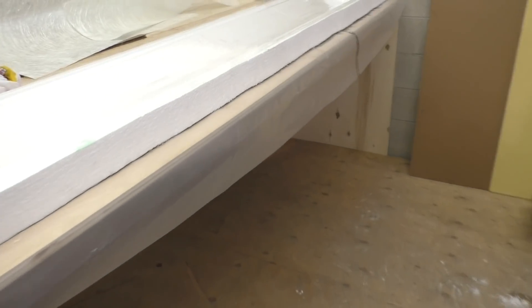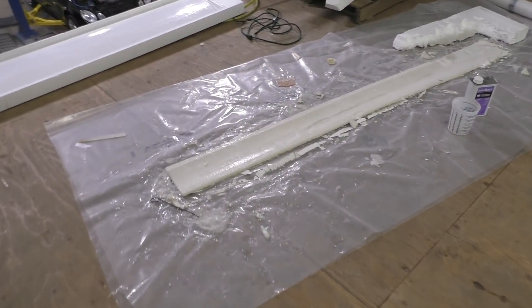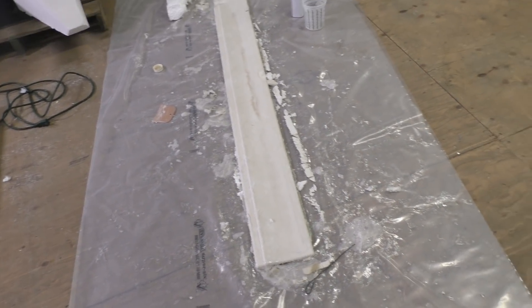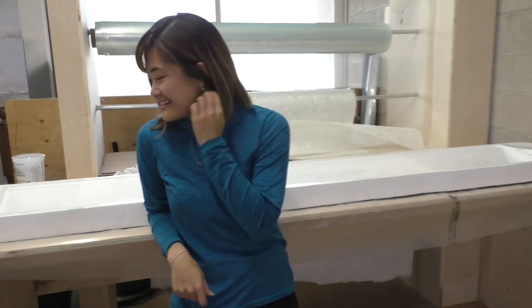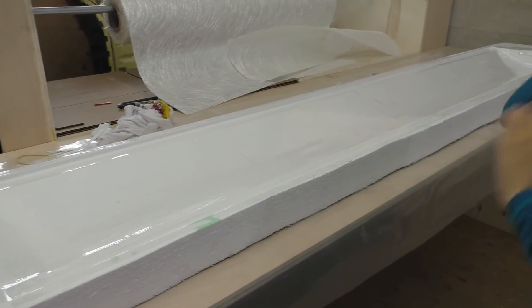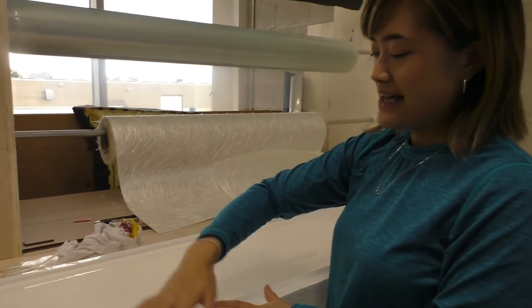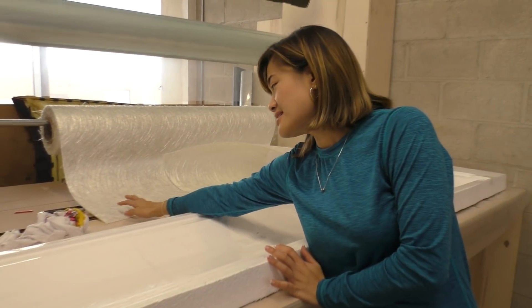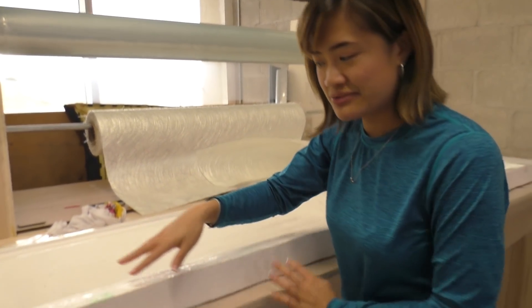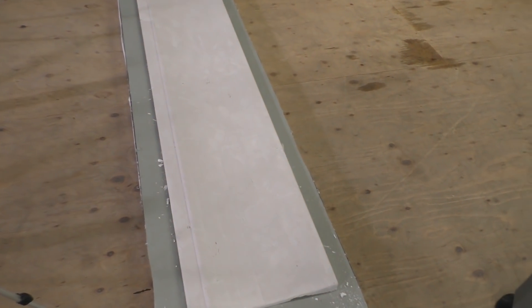For making the rear wing we started off by making these molds that we cut on the CNC. They're foam molds, and I actually made a lot of failed attempts — I've already thrown a few away and these are two of the ones that I still didn't make properly. Finally I just gave up and thought I should let Karen do it — she's the one that came up with this way of doing it. It was a simple fix: just using packing tape along the whole thing, then pouring the plaster and using fiberglass to make it stronger. And it actually releases way better — there's one over here that we did using this technique and it looks a hundred times better.